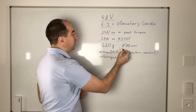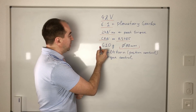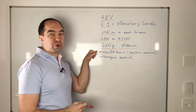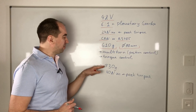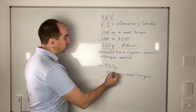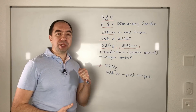The physical dimensions are 98 millimeters in diameter and the weight is 610 grams. It supports multi-turn in position control and also has a torque control mode. The second actuator is a little bit heavier — 730 grams — and at the same time more powerful, with 40 Newton meter peak torque, which is quite a serious value. Today we're going to test both of them.